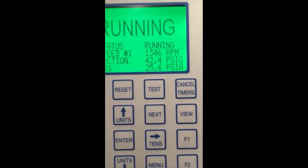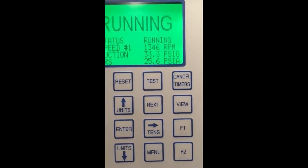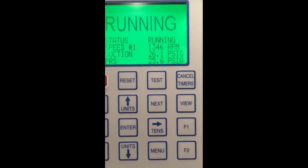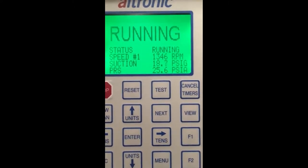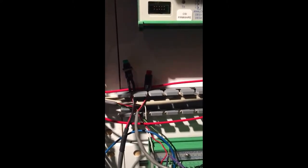Now what I'm going to do is drop the suction pressure down just below 20. Okay, 18.1. Now I can see that the red light is flashing pretty steady — about equal time on, equal time off. Kind of cool. If you remember, the green light when I was at 40 pounds was really flashing and almost to the point that it was staying on.